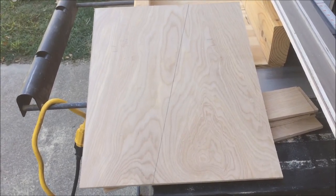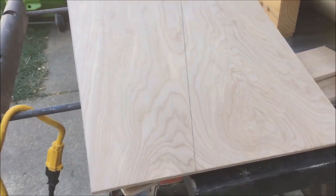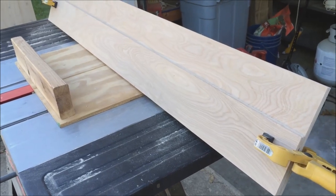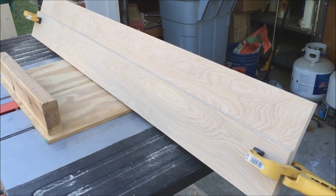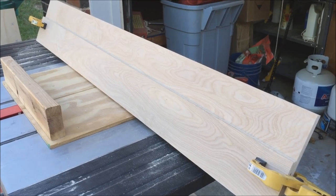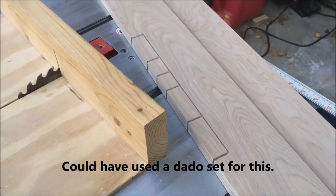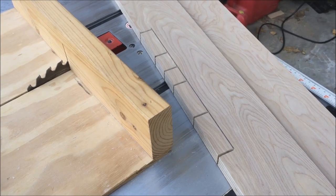This piece will be the side panels. I'm going to take it to the band saw and make this angled cut. I need four of these for my two sets. To cut the notch out of the middle of these, I'm going to use the table saw to cut each end. I'll clamp them all together, hold them vertically in the sled, and that'll make them even all the way across. After making a few passes with these vertical in the sled over the table saw, I'm going to take it over to the band saw and take out the chunks.